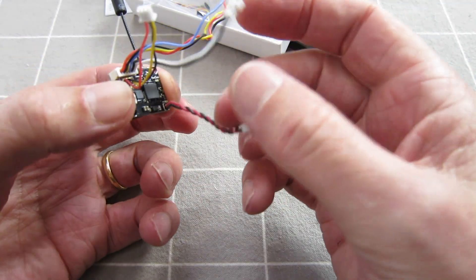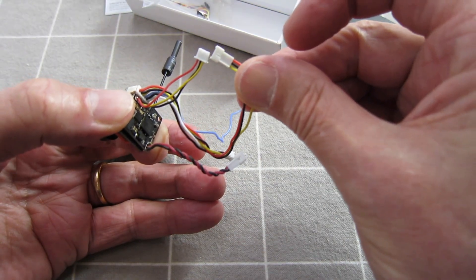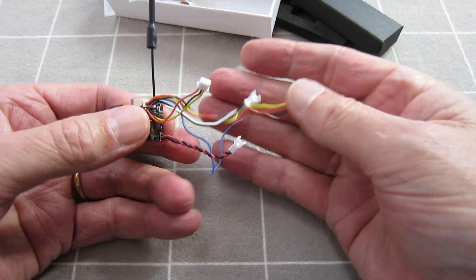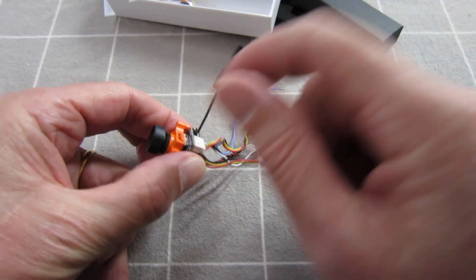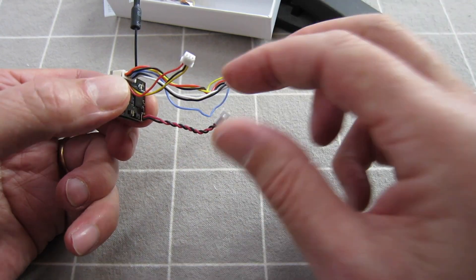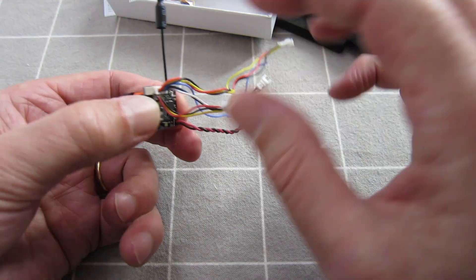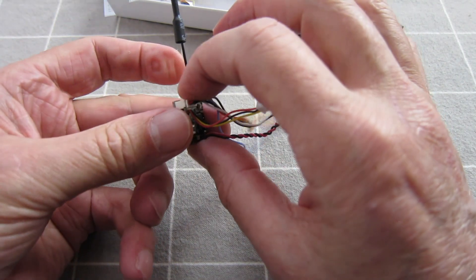Power in for the transmitter there, and it provides power out, but there's no point just connecting these two wires and expecting it to work — you need to power them separately. It would make a lot more sense if the transmitter could output enough voltage to run the camera, then you'd only have one power connection. I guess to have a transmitter this small you need it to be low power, and you need the camera to be able to be run from the flight battery, so yeah, I suppose that makes sense.